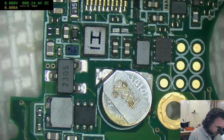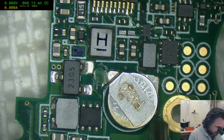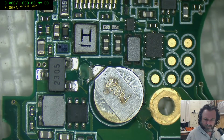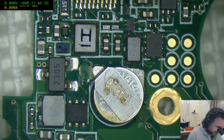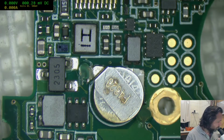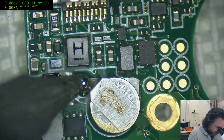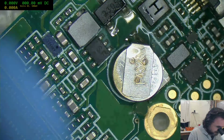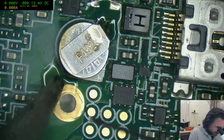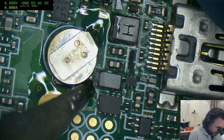That itself is spot welded, but the assembly onto the board is not spot welded. So you buy these as a pre-spot welded unit and then you solder them to your board. But you've got to do it really quick, because otherwise they do have a tendency to rupture. And sometimes I do wonder with these manufacturers if they kind of muck that up.